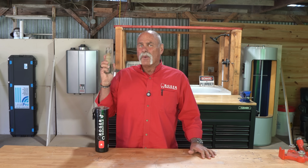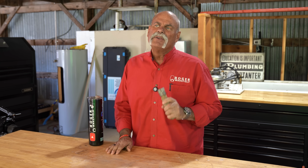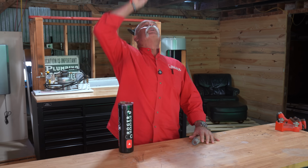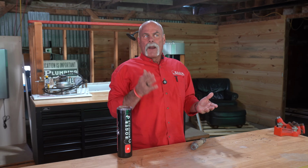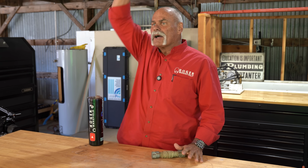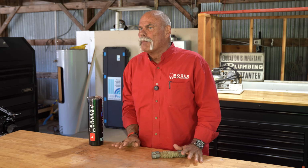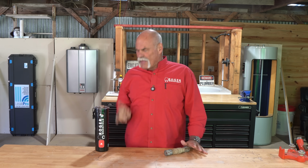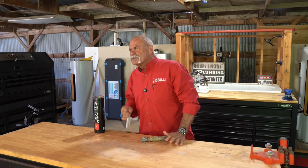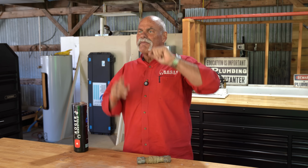Okay, do any of y'all know what a plumb bob is? Well, this is the way we used to do things. Literally, if you had a hole on the floor and you were trying to set an anchor, or maybe put anchors in to run a piece of pipe, or maybe you were gonna make a hole so that line could go straight up through the floor above, if you didn't get out there and set sleeves in it first, you'd do that. You would literally hold it up on a ceiling, up on a ladder, put your plumb bob in the center of that hole to make sure it's perfect, make your mark up there, now you knew where to go through. Well, I have new tools.